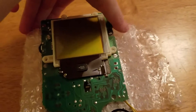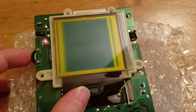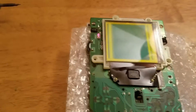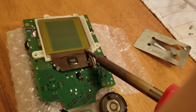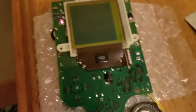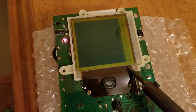What I used here was some bubble wrap to help the ribbon cable identify that it is on something. Now what you're going to want to do is just stick the soldering iron on there for a couple of seconds, and you can see that the lines come back. It's kind of hard to do this one-handed, but you can see the lines just come back bit by bit. It seems like if I just lightly touch, they slowly start to come back. I already got the other side done, so it's just this side I've got to work on — slow but surely it is coming together.